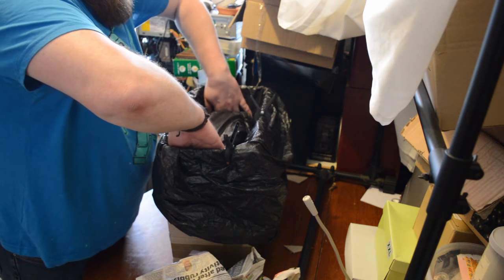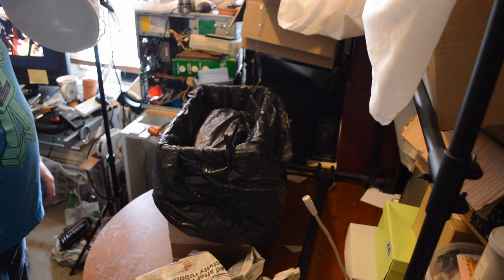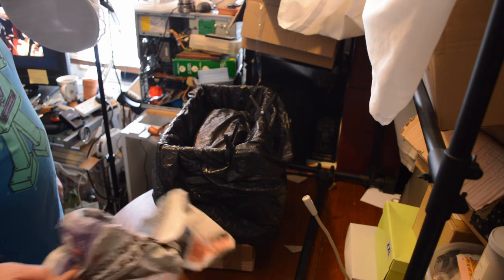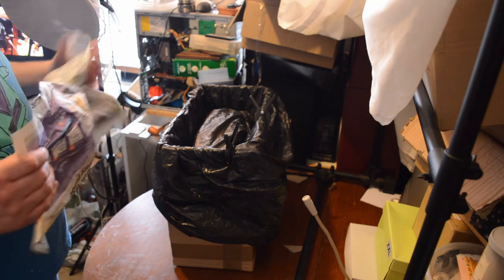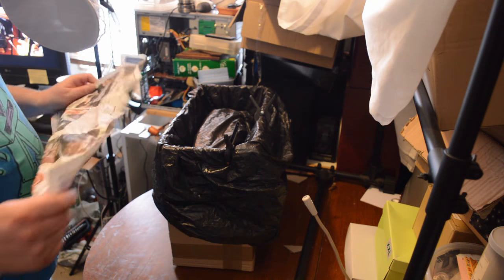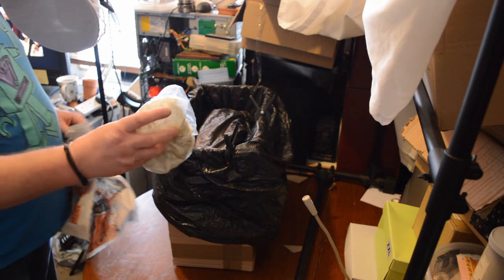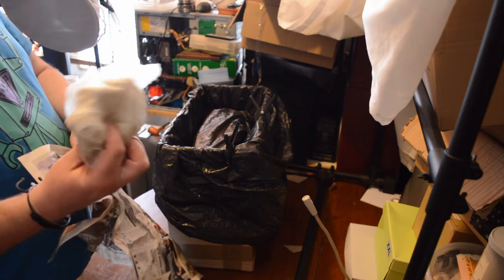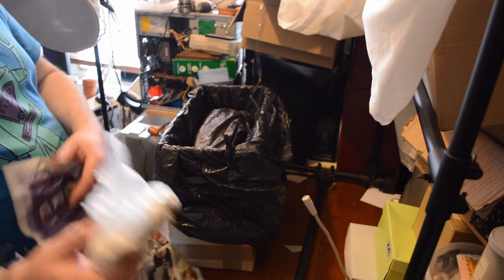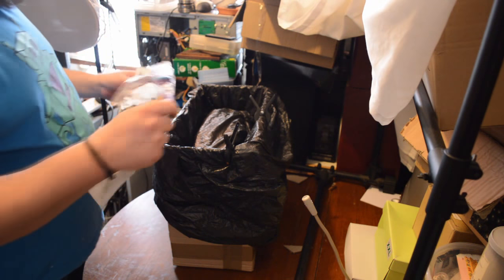So we've got, and it's been established that the expanding foam sticks better to wet paper than it does to plastic. And in fact, plastic will stop it from going off. As you can see here, this is still quite soft and movable. That's been about 2 hours now. So it needs to be exposed to the elements to be able to go off cure.